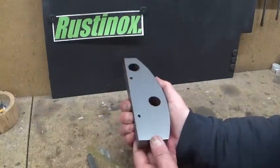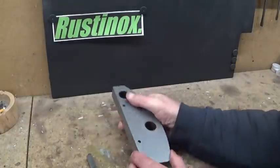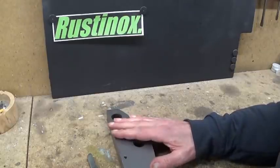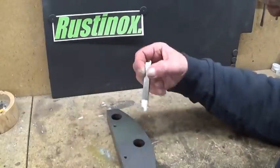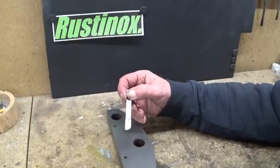Now, what's good in this small step-over system I just made with this new gear is that I don't have to change the tool if the surface finish is not really important. I can have a decent finish even with the roughing tool, so I don't need to switch to another tool, to a shear tool, for example. Of course, I know that if one day I want to make real gears, I need more precision than this template and flexible sheet metal finger system. But we will figure it out.